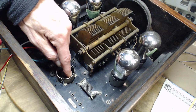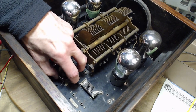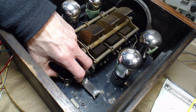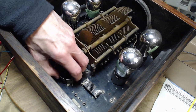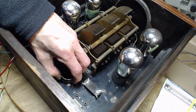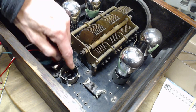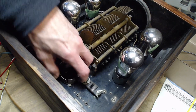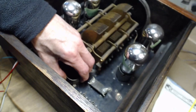I've been looking at the split in the socket here thinking it's just what sockets have — but I don't think sockets have splits in them. So that's an example of the socket fracturing all the way through. There's more cracks forming, and somebody put this wire on to try to tighten this right up. There's a huge amount of springiness in this metal — no wonder it cracked. It's made with a huge amount of that, and that's why it cracked.